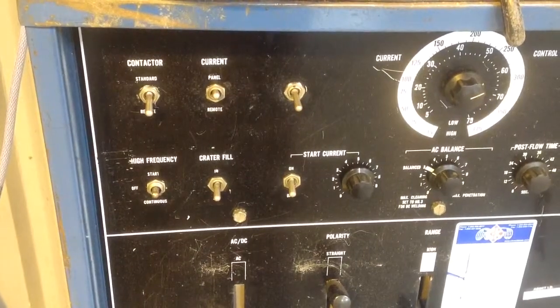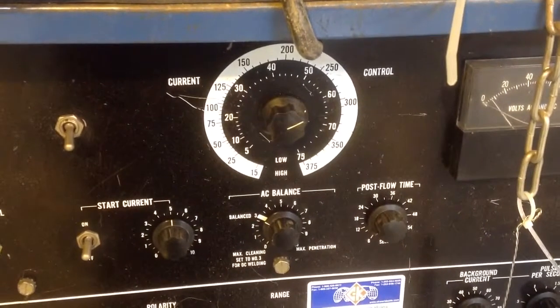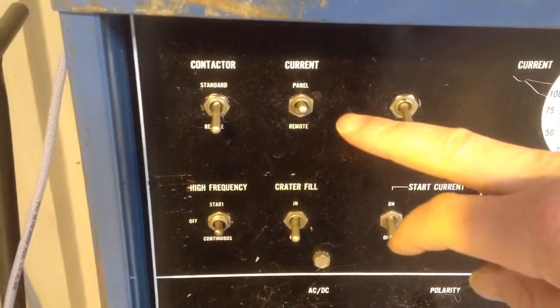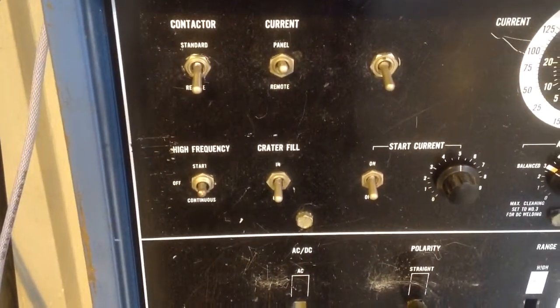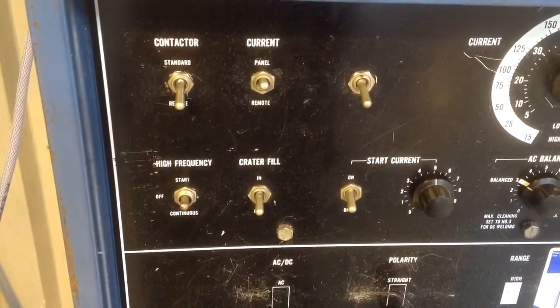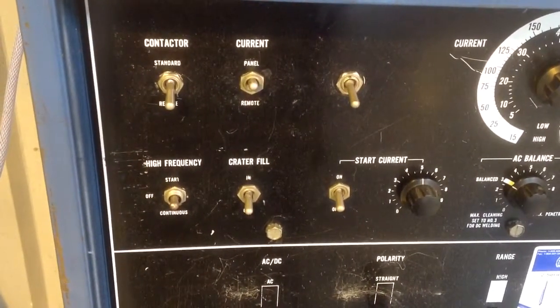What I'll quickly show you tonight is some speed tacking. What you've got to do is if you'd normally weld just over an amp per thou for stainless, we want to double that. So for 30 thou stainless, I'm using a shade over 60 amps. I'm not using the remote control, I'm using the foot pedal to initiate the arc, but I'm switching the current control to panel. So it comes bang up to 60 and off for a tenth of a second. If the parts are actually touching with nothing between them, that will form a little fusion tack, which on 300 series stainless — which is not sensitive to rapid cooling, doesn't harden, and is not heat treatable — will form a very strong tack.